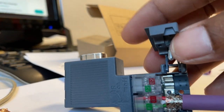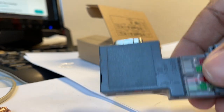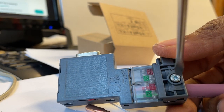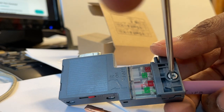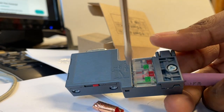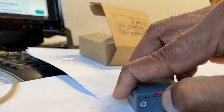Now make sure you've got the shield. Once you cut them right, you're good. Make sure this shield is touching the ground connector there — the ground metal. Now put this in, use a small flathead screwdriver and just secure it in place. Then you've got the connection made. If you want to continue this — if this is your last connection point — then just move this terminal resistor to the on position.